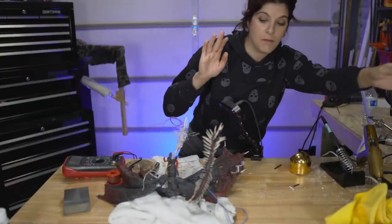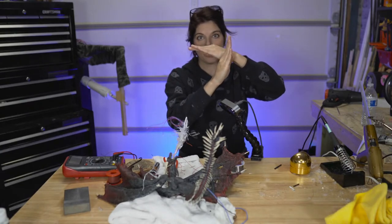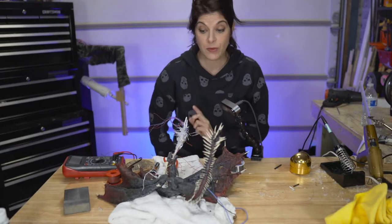But if this is the resistor, the wire was passing through, and say my fingers are the wire, it slipped and the wire came in contact with the other wire. So what I did was slip that wire back on top of the resistor and glue it. That way these two wires can't touch, no touchies anymore. So that was that problem.